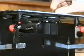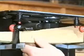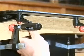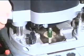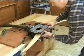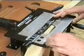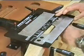Mark the back legs as a pair having first profiled the shape. Leave the top and bottom over long. Machine the side rail mortise first and set in the jig, using the downstand on the setup bar against the flat portion of the leg. Machine to a depth of 35mm. Rotate the leg through 90 degrees and line up for the other mortise. Use the setup bar to set the position of the sliding templates and machine as normal.